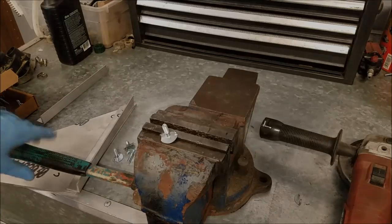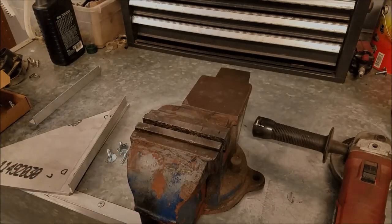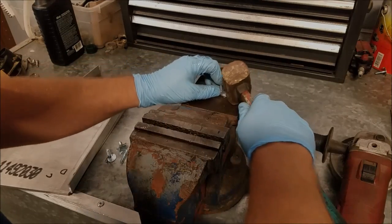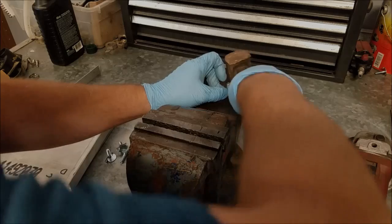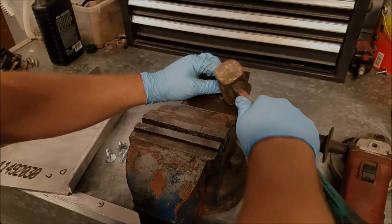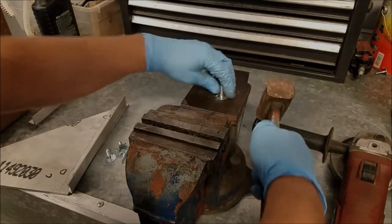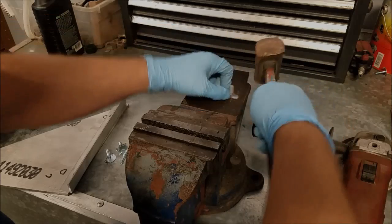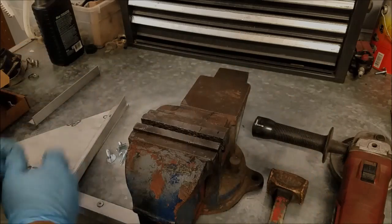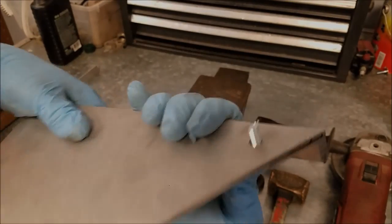So in full disclosure here, I know you can buy these elevator bolts without these little locking tab things here. Problem is they all have a square base to them. They're almost like a flatter carriage bolt. So I didn't want to go that approach solely because I didn't have a square broach. I looked up the price for a square broach and decided cutting these and bending these would be a better idea. So that's where I am, in case you're curious. Now, should I just cut these off? Probably. And that is kind of the plan.